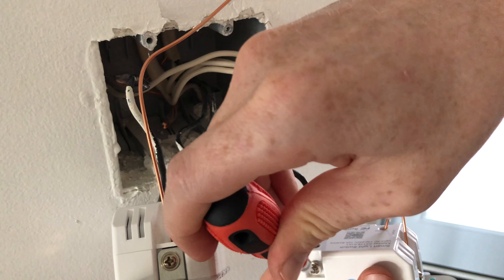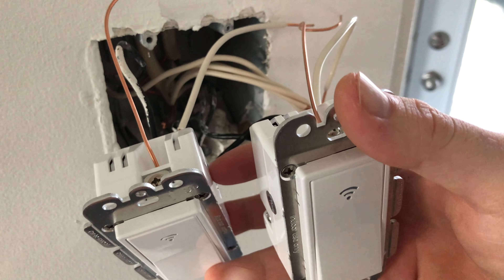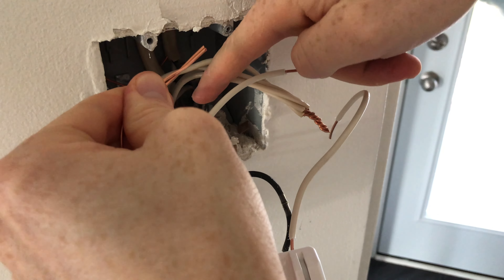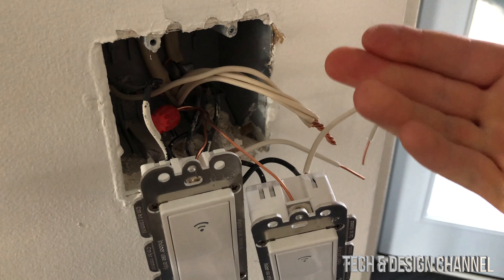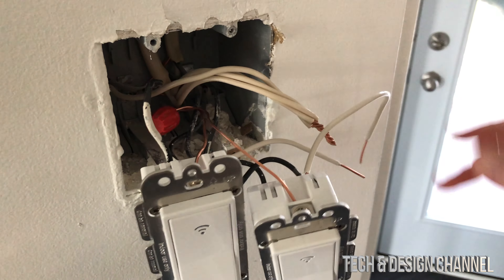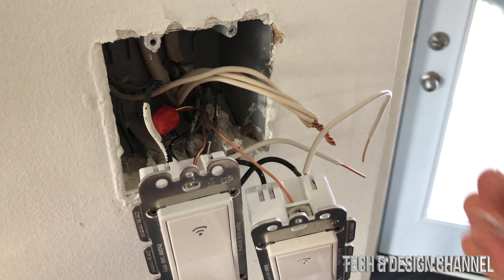I'm going to switch around my live and load so everything makes sense — just make sure this is oriented upwards. It's no big deal if you do it the other way around; it just looks nicer if the Wi-Fi indicator goes up. We're putting the ground together first because it's all the way in the back, then the white cable which is easiest since it's out front. I hooked the ground up back there with the rest of the ground. Before I close all this up, I'm going to test that it's actually working — I don't want to close this and find out I have to take everything back out. Sometimes connections get loose once you push it in, so it's good to test before putting the plate on.